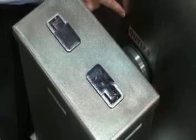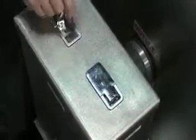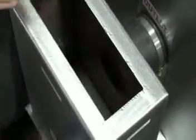This is the outlet of the Highland Tank AGI. In this particular case, it's fitted with a sample port. The sample port, once again, has easy flush mount latches. In this case, the AHJ could remove a sample right here to check for effluent quality. As with all interceptors, there should be a vent stack on the outlet leg of the interceptor.